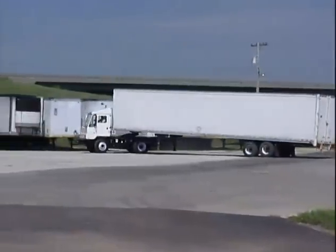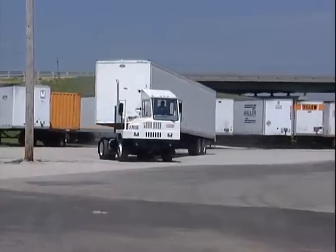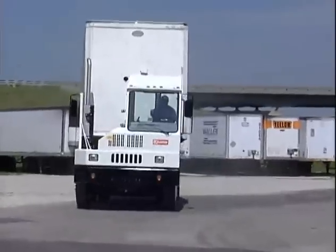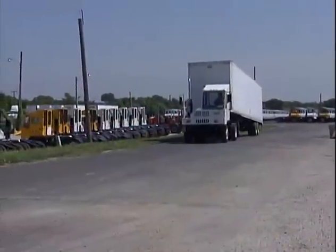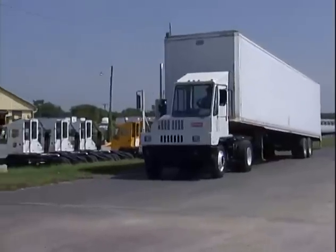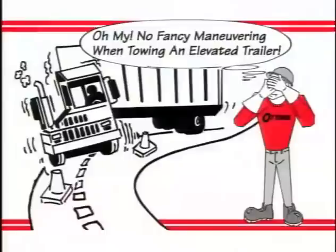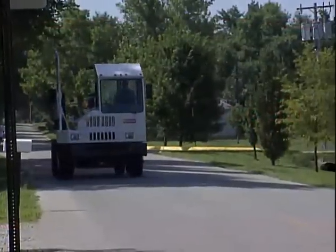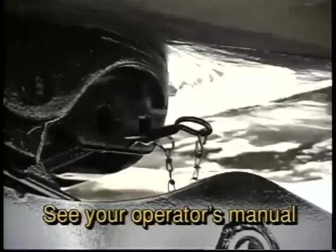Just a few more things to keep in mind. Your Ottawa is designed to move trailers for generally short distances and in somewhat confined areas — it is not designed to operate the same as a road tractor and shouldn't be driven like one. When hauling a trailer in the yard, speeds should not exceed 15 miles per hour. Since your Ottawa hauls loads with the front of the trailer in an elevated position, the load is not as stable as in road tractor operations. No fancy maneuvering when hauling an elevated trailer, and no fast turns or jackrabbit starts. If you are driving a DOT EPA model, you must manually lock the kingpin locking jaws before operating on a public road, and manually unlock them before you can unhook the trailer. See your operator's manual for details.